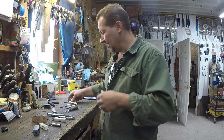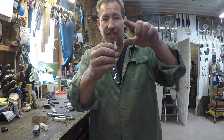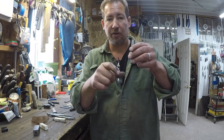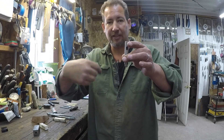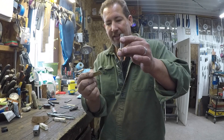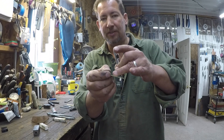The way you do that is you take one of these end mill cutters, chuck it up in your mill, clamp the liner down to a rotary table, bring this down, touch off, go down another 5 or 10 thousandths, crank the little wheel on that rotary table, it goes around, spins the liner around, and mills that section out.